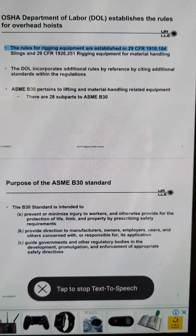Lecture 31. Hoist ring dos. Visually inspect the hoist ring for any damage or corrosion on threads and body. Ensure placard information is attached; if not, remove from service. Must use a torque wrench for installation. Make sure the thread engagement is appropriate for the base metal being threaded into: approximately 1x the diameter when threading into steel, approximately 2x the diameter when threading into aluminum. Verify swivel function after installation.